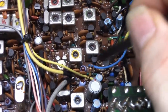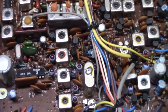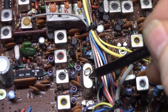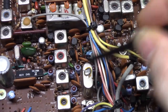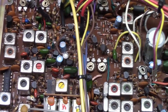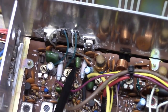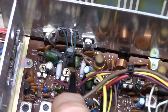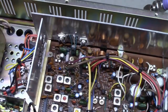This is an earlier radio with a full-size crystal. These are more stable than radios with small-package crystals — bigger is better when it comes to crystals. There's a little glue around the 455 ceramic filter that I'll get cleaned off. You can see glue oozed out around the leads on that transistor, but with just a plastic spudger you can see how easily that stuff comes up. Still a little bit rubbery, doesn't look like it's gotten corrosive or conductive, so thumbs up — a lot less work to do.